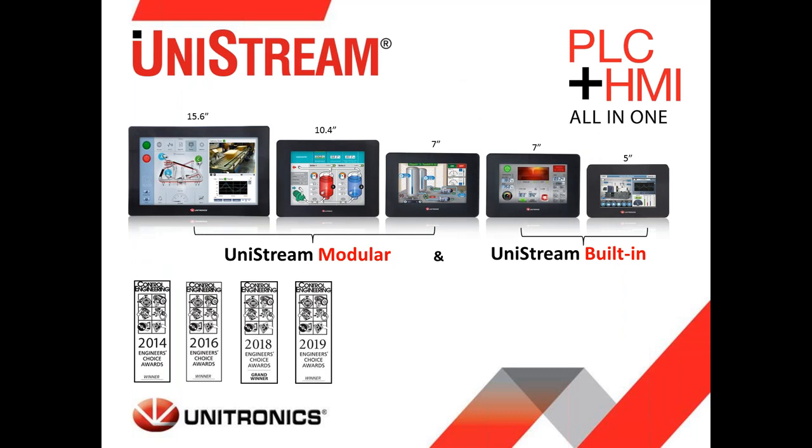The UniStream series comes in a few different flavors. We have the modular UniStream series, which comes in three sizes, 7-inch, 10-inch, and 15.6-inch. These controllers will utilize a CPU on the back with customizable I/O configurations. So you put together the I/O that you need for your project.